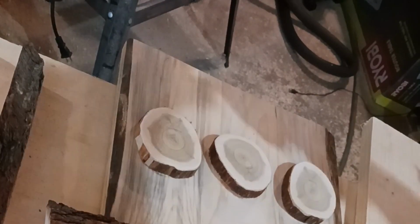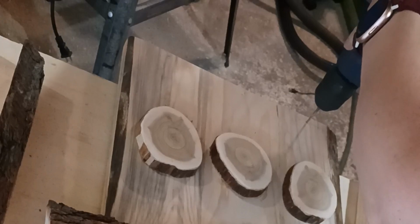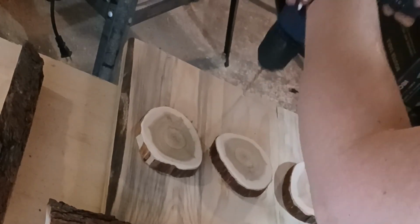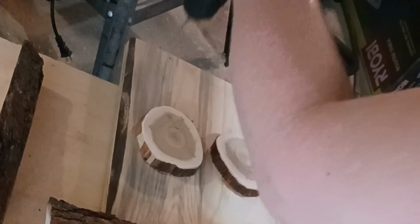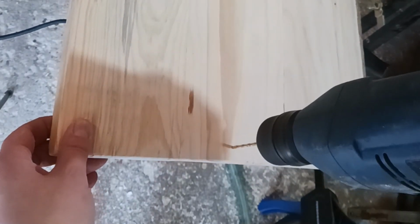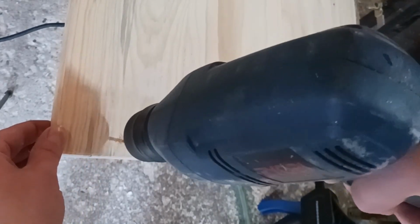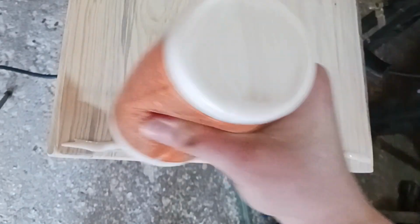After this, I'll repeat a similar process for the shelves. If you want to, you can repeat the same trick with the glue, but I just noted approximately where the center of the board sat, and I drilled there. Then I do it on the bottom too. These will ultimately be hidden and don't need to be perfect, but be careful to drill straight up and down to avoid coming out the side of the board.